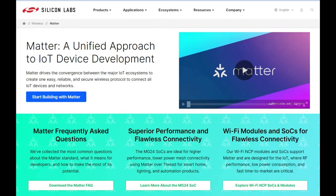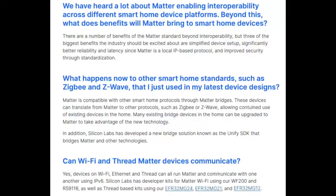It's sort of like if you want to have a website — you can write it on a Mac but view it on Windows, Android, or an iPhone. It is a standard, and it's based on IP from TCP/IP. You get to choose your transport; in this case we're talking about Zigbee, but you can also use Wi-Fi, Ethernet, or cellular. If you need to step up from the throughput or power profile of Zigbee, you can always change the underlying transport and keep that upper layer of Matter compatibility.